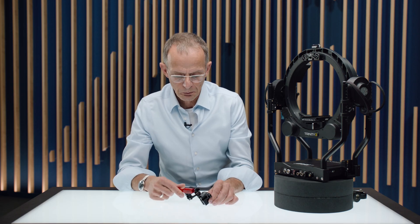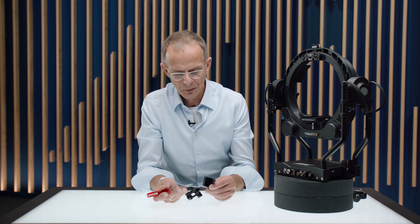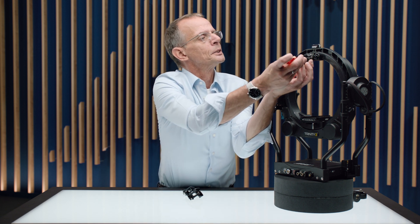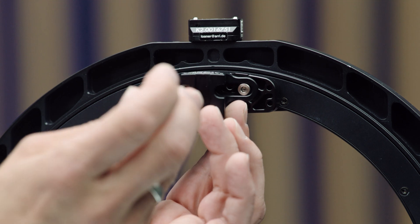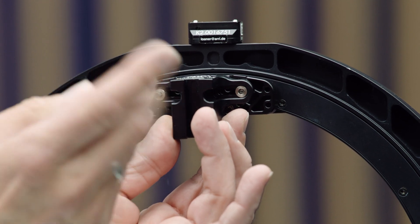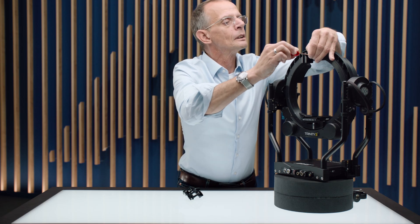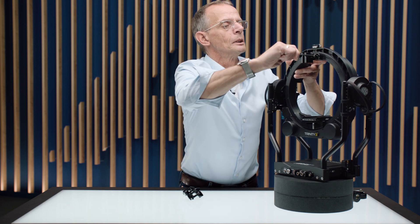To mount the TAP-1 base against the SSP-4, which is already mounted to the ring, you need a 3mm hex key. First, move the first screw to the end of the slot, then bring it to the SSP-4. Then move the other screw right to the end of the slot. Then tighten this side, and tighten this side very well.